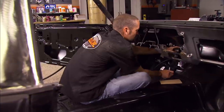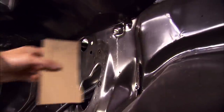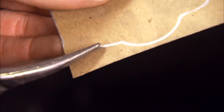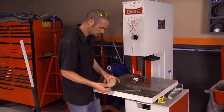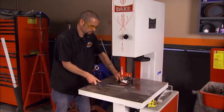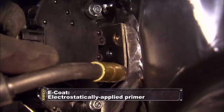The LS7 uses a drive-by-wire gas pedal — no cable or rod like a traditional setup — which means we need to build a custom mount. The pedal doesn't have a lot of travel, so the bracket also has to be designed for proper location. Brent's come up with a two-piece design: the larger piece will bolt to the pedal, and the smaller piece will attach to the firewall. This is why we never throw out small pieces of metal — this scrap of eighth-inch plate left over from the Impala frame is now becoming part of the Trans Am. After buzzing off the e-coat and finding some bare metal, the gas pedal finds its permanent home.